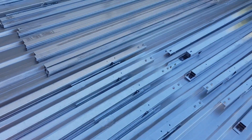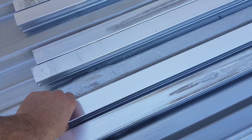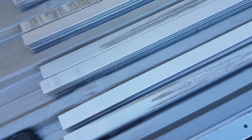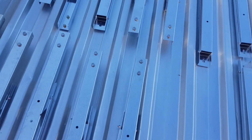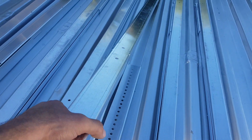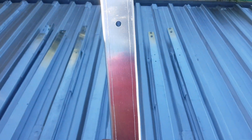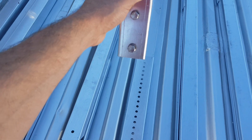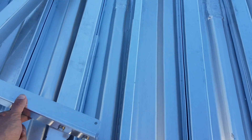Today we're installing these brackets. These are the A-frames from KD Solar, and there are the normal aluminium rails where the solar panels can just attach to. The sunlight is a bit straining on the camera, but just bear with me. These brackets are A-frames — they get shipped flat like this, and when you put them together you just bend this part upright and then lift the A-frame.